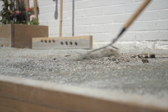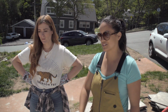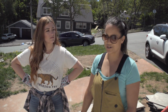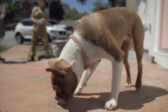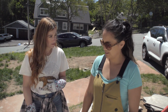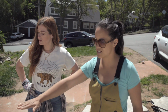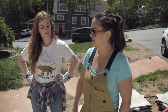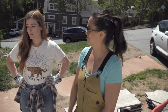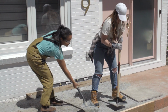We were a bit high because the foundation of the house is right there and the brick is above it. So you should stay below that so water doesn't penetrate into the house through the mortar. So are we going to have the tiles angled slightly towards the front so the water drips forward? Yeah, there'll be some grading and we're going to match the grading on this concrete pad and follow it along this way so that everything kind of slowly drips towards the garden of the plants. Well, thank goodness you're here because I would have just made everything level and flooded my house.